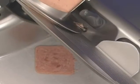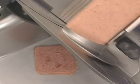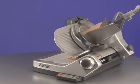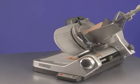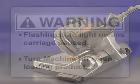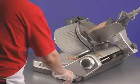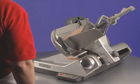Press the Auto On Pause button to start slicing. The product tray moves back and forth at the speed and at the stroke length you have selected. When done slicing, you may stop the machine by pressing either the Auto On Pause button or the Off button. Warning: flashing auto light means the carriage is paused. Turn machine off when loading product. Pressing the Auto On Pause button returns the product tray to the home position.